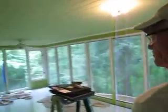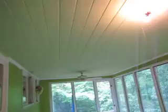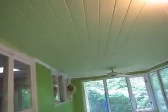Well, the main thing, this is her favorite little room right now. This is the biggest project. This is the sunroom. It was some kind of beigey yellow. We primed all the walls and windows with oil primer, because it had oil base on it. It had been painted with oil, so slick.